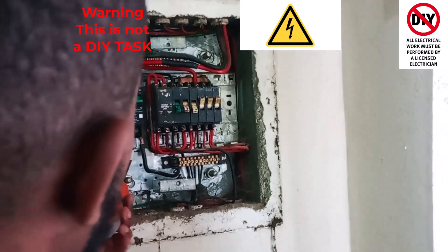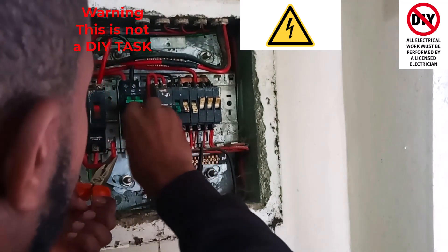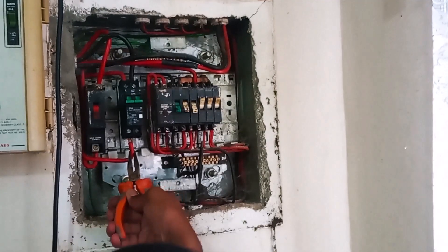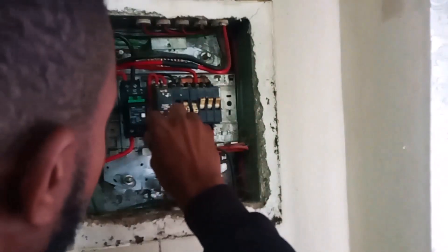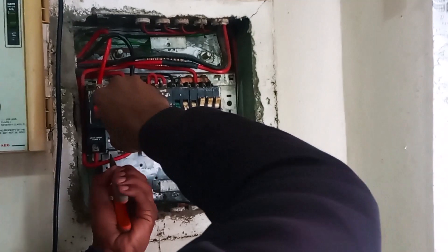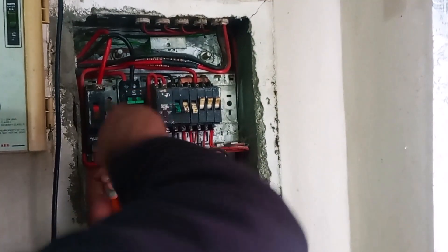Now I'm working off-grid, so it's not live, but still you have to be careful. It's not because the circuit is off that you can start touching wires like nobody's business — you will have a problem. To avoid getting yourself hurt, you have to avoid touching any wire. You must assume that it is energized. That's a very good assumption to have. Every wire here is energized, and that's the only way you're going to avoid electrocution.